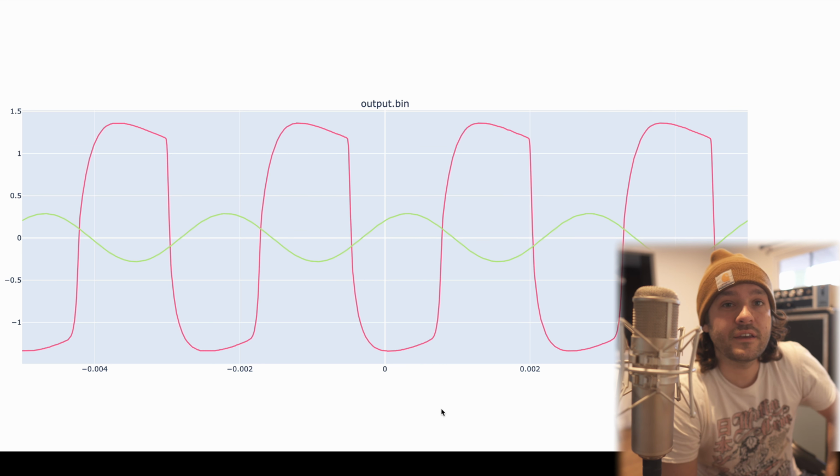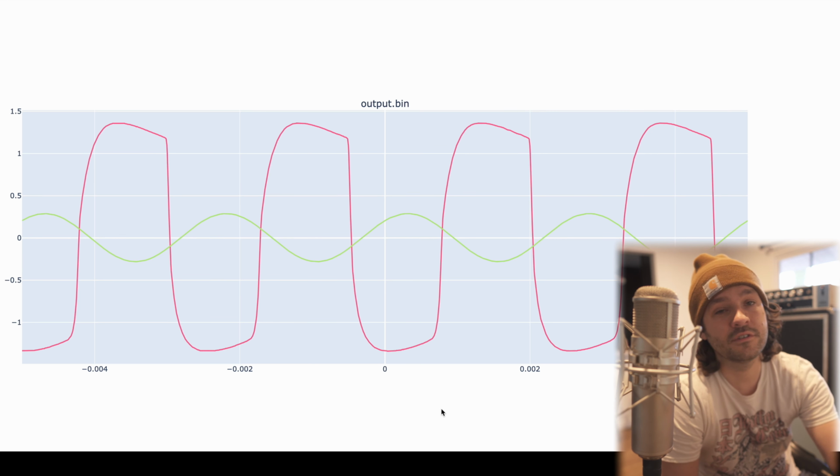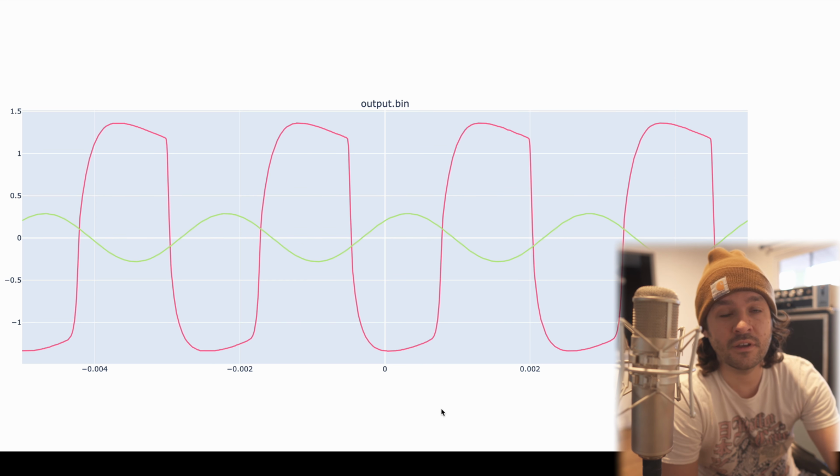Even though this looks like a fairly small signal, plus or minus 1.5 volts for the volume being at half, we have to remember that that volume pot is logarithmic. So as we get closer to bringing that wide open, this voltage signal is going to get significantly bigger. And with that voltage, it still has the current capability, and that's where we essentially increase the overall wattage of the amp. So we've probed the signal.